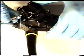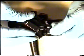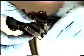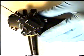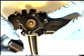Next step is to loosen the 3 set screws which hold on the left-right lock knob assembly cap. Find your set screws and loosen all 3. Notice where the lock knobs fit when they are in the free position. They both line up diagonally to the head of the instrument. Again, take the parts off in sequence, lay them on your work area so you can reassemble back in reverse order.